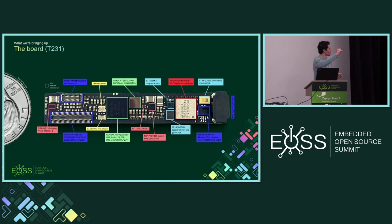It's 10 millimeters high — a little board that integrates the MCU in the center, external flash for the code, display and camera connectors, various oscillators, power management, some sensors — accelerometer, magnetometer, gyroscope — and a Wi-Fi module from Silicon Labs. There's a lithium polymer single-cell battery it can charge. There's a USB Type-C connector on the right-hand side, and SWD debug connectivity is exposed on sideband-use pins of the Type-C connector in a slightly non-spec-compliant interpretation of the USB debug accessory concept, used in some other commercial products.